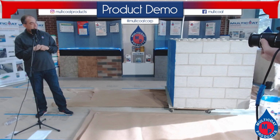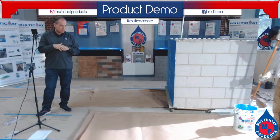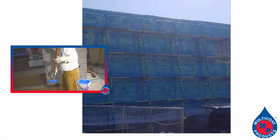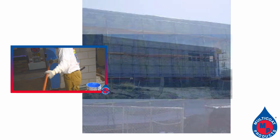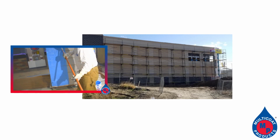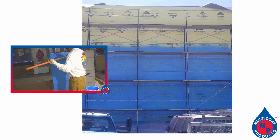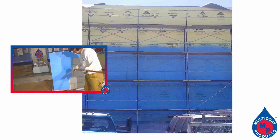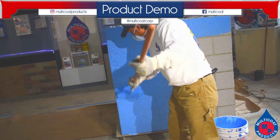While he's starting to roll this, our Multicoat product, we also use for other applications. We have our air barrier, where you get 150 square feet per gallon of coverage. It's showing you pictures of our air barrier in Salt Lake City. Again, easy to spray. If you're using it as air barrier, it goes on fairly thin. And you get 750 square feet of coverage for a 5-gallon bucket. We have a system that we can send you with all our specs for air barrier products.